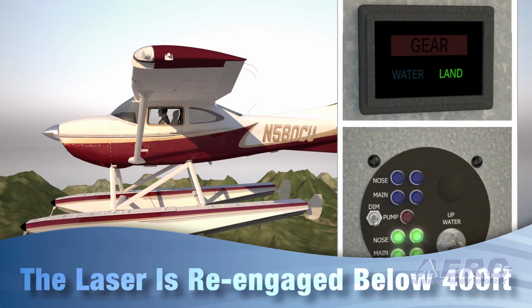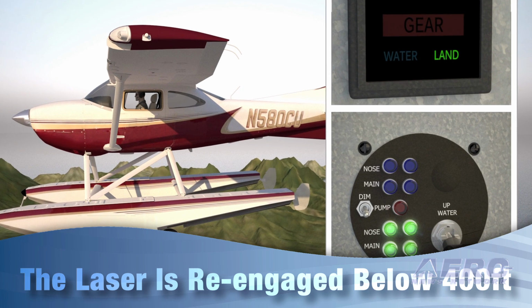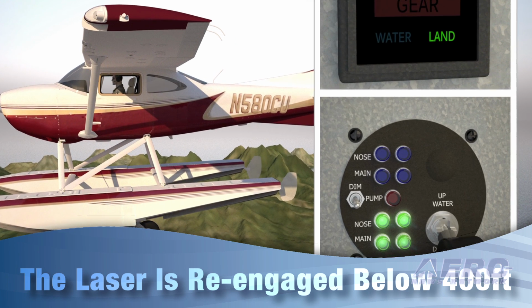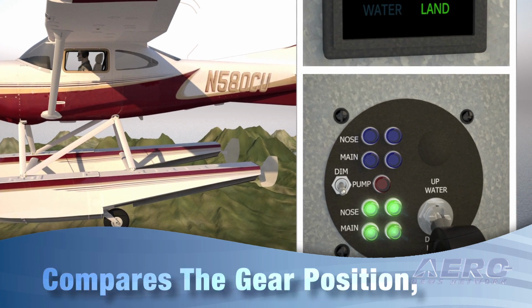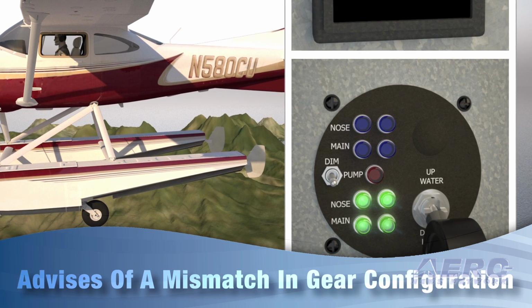Descending through 400 feet above ground level, the laser is re-engaged, activating the illuminated switch, which indicates water if the laser detects that the airplane is over water, and land if over solid land. The Laser Gear Advisory compares the gear position, detected terrain, and airspeed to accurately advise the pilot of a mismatch in gear configuration.